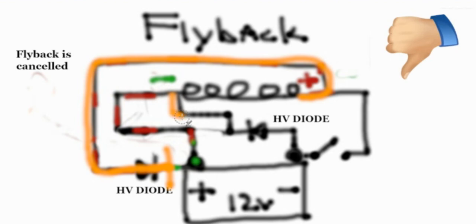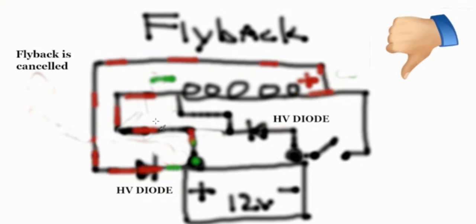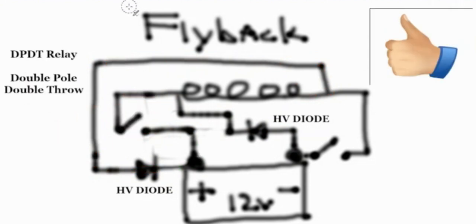The intention is to have it go this way. So the only way to do that is to add a switch right here — and that would be this circuit, which is correct. Place your positive from your battery right here, and you do that when the switch is closed. Both these switches close together with a double pole, double throw relay.